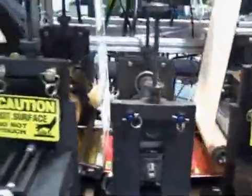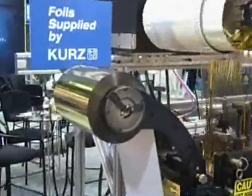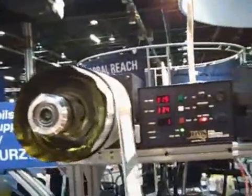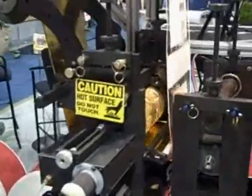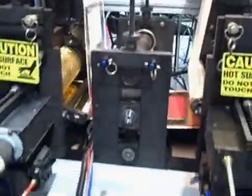we'll come to our first cutting die station, and at this station we're unwinding foil here using two foil unwind arms, and we're rewinding the foil waste up here on our Webstream foil rewind system here. There is the temperature controller for our first hot stamp unit, and down here is our first hot stamping system. It's a DMS 10-inch hot stamping system. And we're using this 10-inch hot stamping system, and in this case, a solid engraved brass die to hot stamp onto the piece. Moving on to the second cutting die station here.